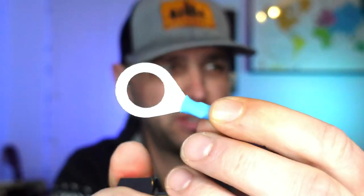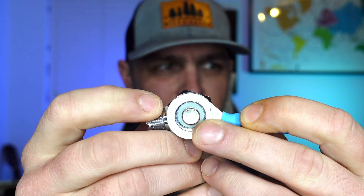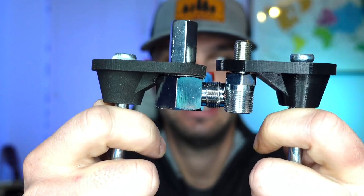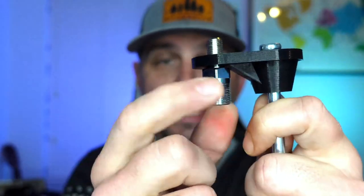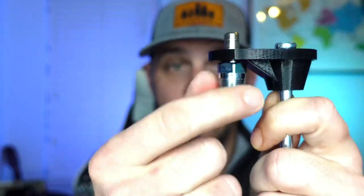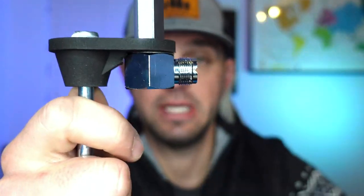There are a couple more things we're going to talk about. Let me show you what I was talking about with that ring connector — it's a big ring connector, and on that elbow connector it fits just fine. Once it gets tied down, it's not going to move. Some people are asking why you need an elbow connector. The best thing to do is show you: they look about the same profile and roughly the same height. But the problem is, once you have the coax in the straight-through — meaning 3/8-inch to SO-239 — the coax is going to come down and you're probably going to need an L connector anyway, or you'll bend your coax to a point where it'll probably go bad after a while. We eliminate all those issues with the elbow connector — it comes out at the same profile, the same depth, and straight out with the coax to the side. No bending.